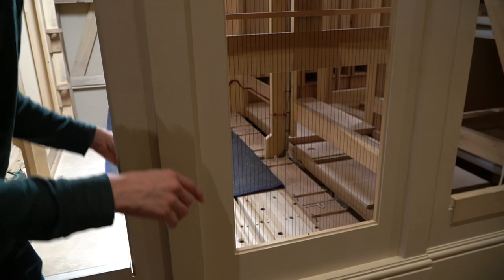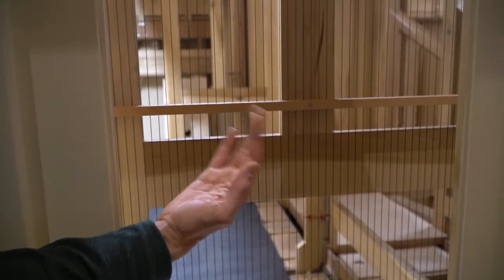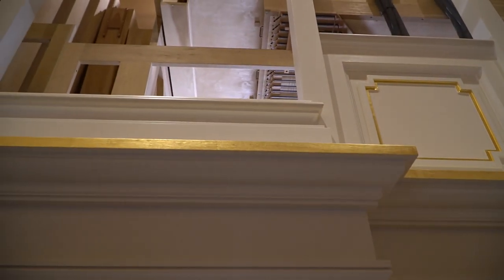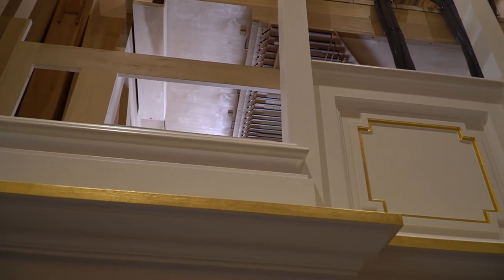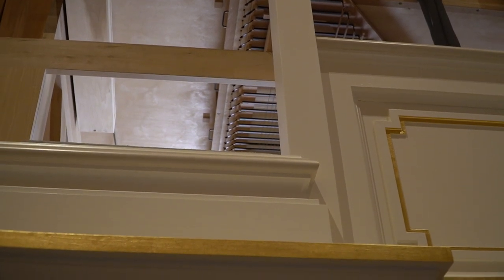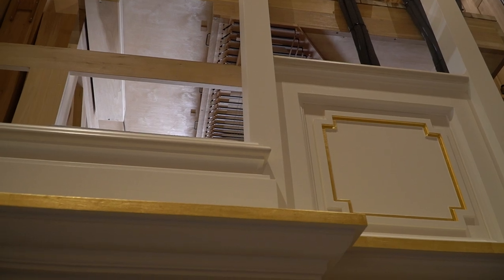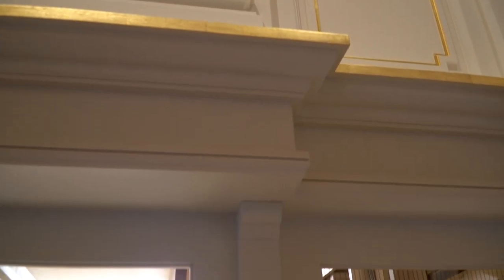So at this point the movement goes up, and it passes through a couple of guides that just keep the trackers from moving around too excitedly from side to side. Then at the very top, we have yet another set of squares, which we can see from the front of the organ. So this changes the direction once again — now they're going horizontally. Then they go to one of these roller arms, and this is where the order of the pipes gets sorted out. Up until now, all of the trackers have been in the same order as the keys of the keyboard, but the pipes are in a different order — that's to save space, and also to allow areas of shorter pipes so we can get in and reach past the pipes and tune them. The row of pipes is also wider than the keyboard, so it stretches out the space between the notes.